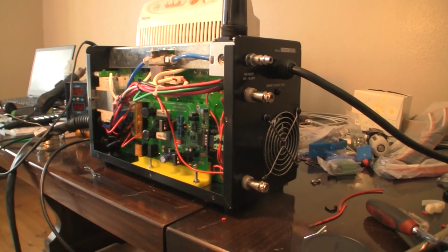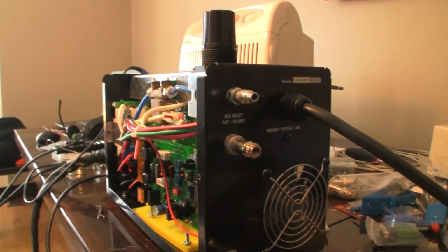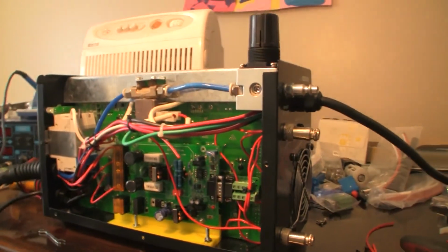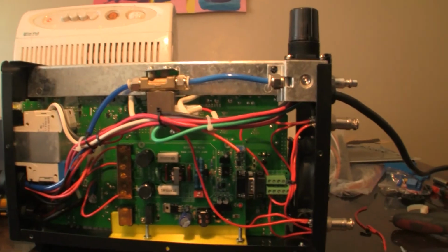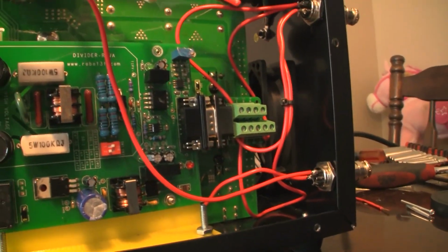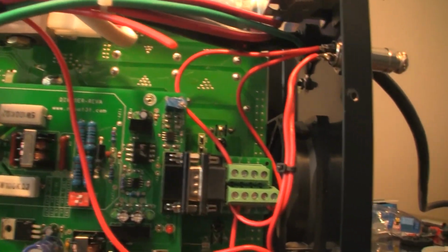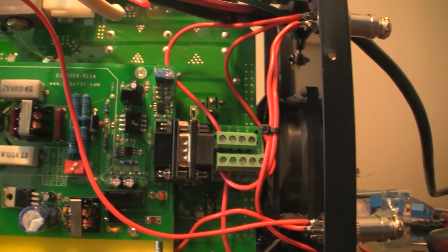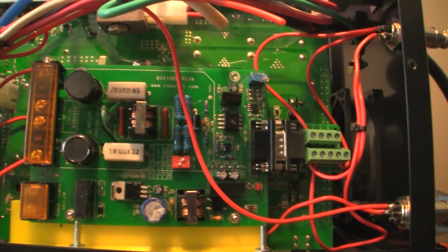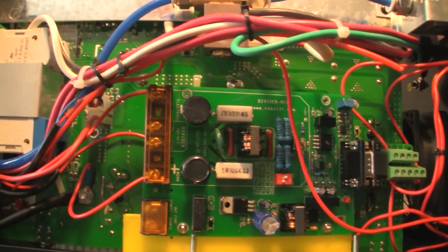This is showing the connectors are all soldered together, and the top one has 24 volts coming in to power the board. It also has 0 to 5 volts from the voltage divider board leaving to go to the torch height control. The bottom of the connector has the wires to fire the torch from the relay from the Linux CNC machine. These wires will go to the housing of the Linux CNC machine and plug into the circuit boards there.